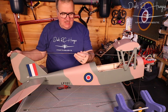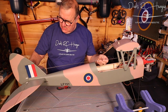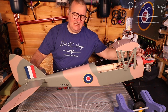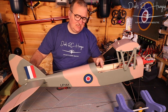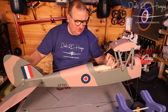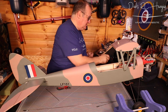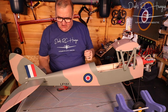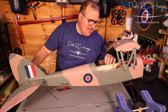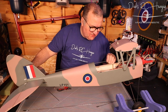Let's stick some rods in. These rods come very generously cut. If that's on the clevises on the control horn - I'm remembering all these names now, it's brilliant. So the servos are actually here. I've been told - always measure twice, cut once. That will be on there - that's where that's going to go. The rudder is right back there, and I'll tell you what, we can always cut it afterwards. So let's go along there.